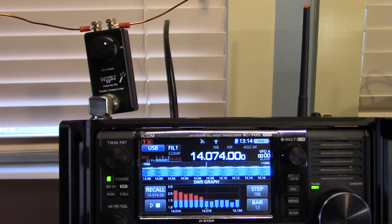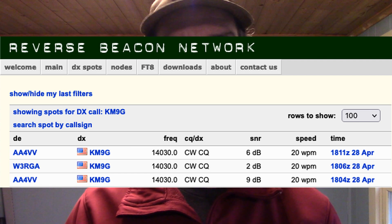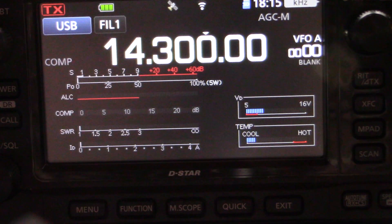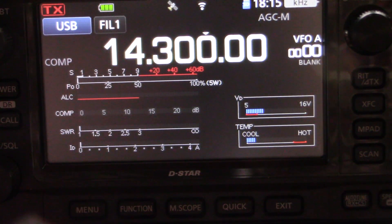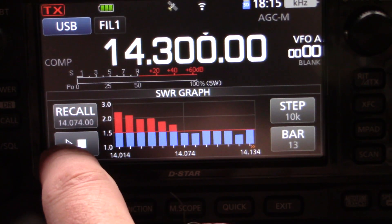Perfect! I don't know if you saw the lights flashing, but it's interfering with my LED lights over on my workbench — so that's how that works. I'm actually starting to hear some FT8 signals. If we do any decodes I'll have some on the screen. FT8 decodes weren't great — too much power. I had to dial it back to 4%, about half a watt. When all else fails, this is CW — indoor CW. Here's another way to tune this thing up: let's go look at where the SWR is now. We have no SWR.